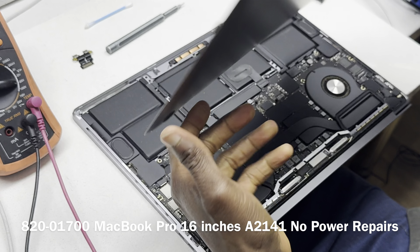I'm using a T5 or T4 — depending on your screw set this might be a T3, but in my case I'm using a T4. Take note that the battery screw is quite long compared to the older machines. This is the longest battery screw you'll find on the newer devices. Apple had a similar battery screw design with the earlier 13-inch Retina MacBook Pro from 2012-2013.